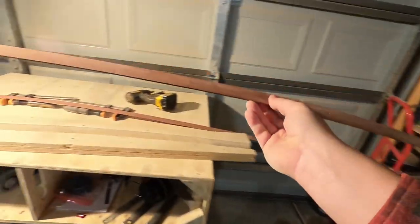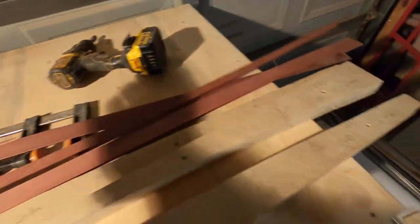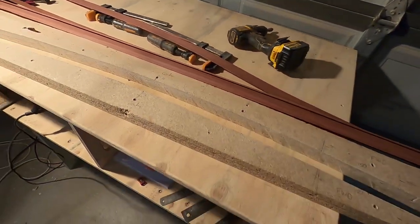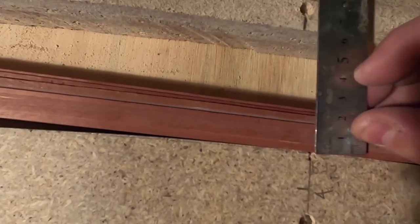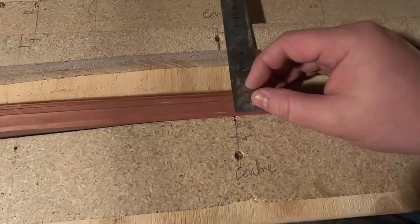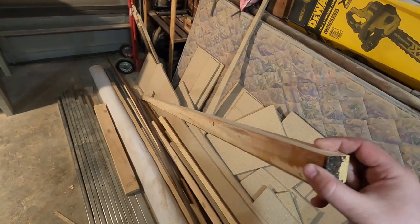Now I have to figure out the pieces and cut a bunch of strips. I have some already - here's a strip, another quite thin strip of Jarrah. There's a thick piece too. In total we've got about 20 millimeters of thickness in Jarrah. We really need to bring it to 45 millimeters, so I need to find some more wood from somewhere. I could cut some of this into strips, although there are staples in this one.